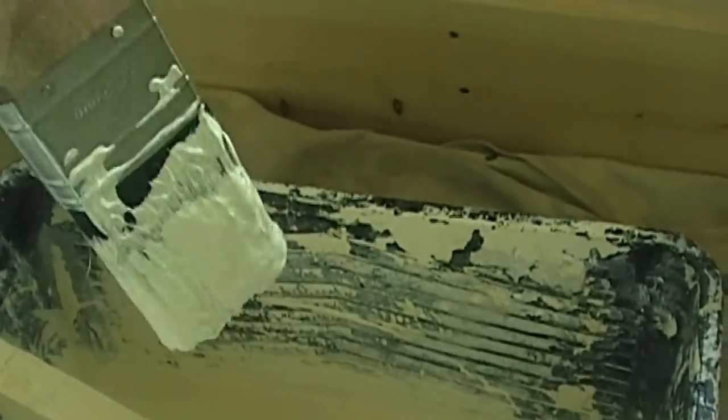That's the consistency now, compared to the consistency of the original paint. Yeah, this is what came out before I added water. This emulsion here, which I have not watered down, is just too thick for the first coat on a porous surface. Hence, we've watered it down. You can see that's more transparent, thinner, but this is okay. We need that transparency and the thinner paint so it keys into the surface.